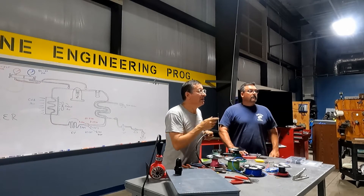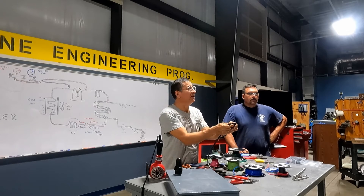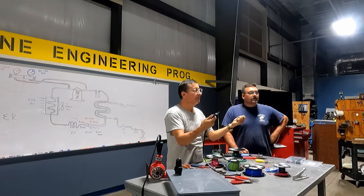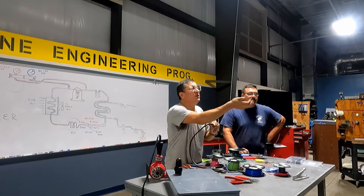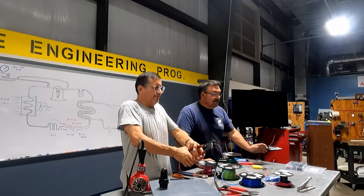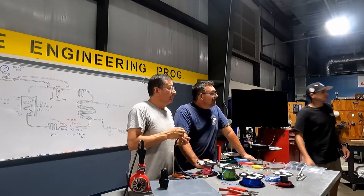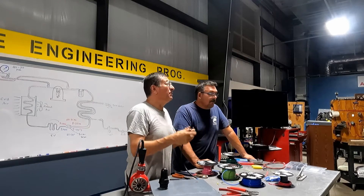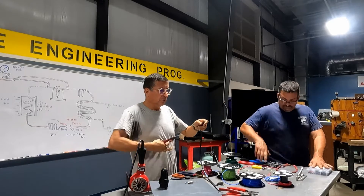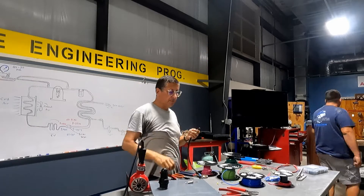For that reason, when I am the manager of the project, I pull all the terminals and demonstrate to my assistant what a professional terminal looks like. Danny and I will pull the cable and check — if it pulls out with one pull, that's not good. You never crimp with a hammer on those teeth. Use the proper crimper — the bigger they are, the more leverage you have.